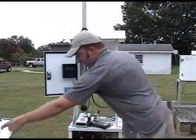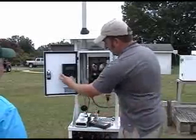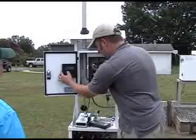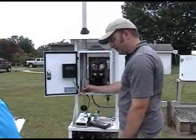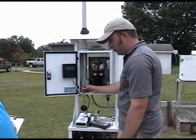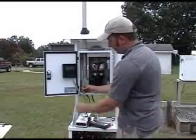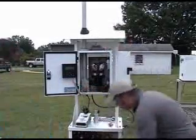I'm going to do a verification and write it down. Yes to save. I'll backspace out of the calibration menu and go into the audit menu where all the verification items are — F3, and temperature is F3 as well. I've got 32.5, so I'll enter that. The sampler reads 32.7, my reference is 32.5, the difference is 0.2. The software gives you the absolute difference — that's well within the plus or minus 2 degrees requirement. Hit enter, yes to save.